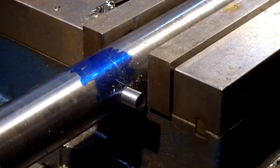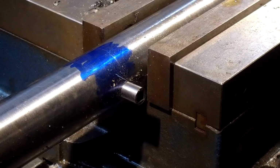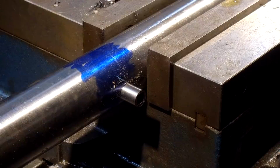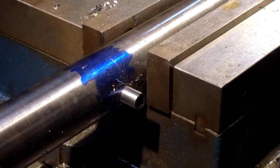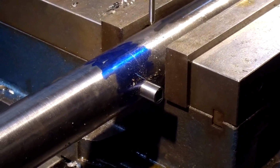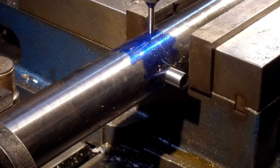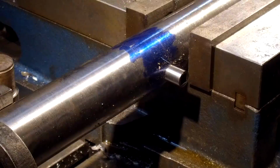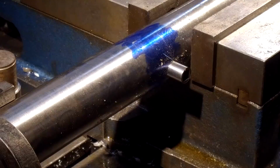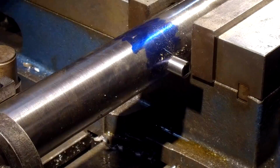Now we can go ahead and we can take our block and we can set it square to the table. 90 degrees here. Right there. Okay. Take our tap follower, which we're just using for a pointer, and we're going to come over and we're going to center up with this line here. And that looks like it right there. Okay, we're going to come center of the bar, which is 875. We zip past it. There we go.